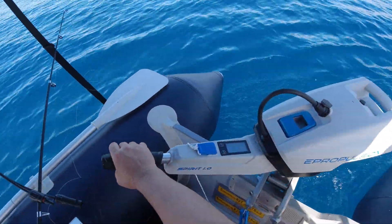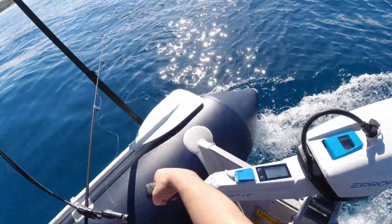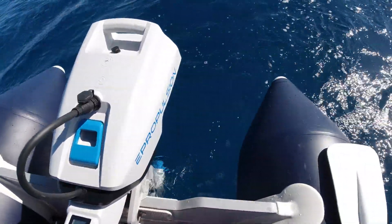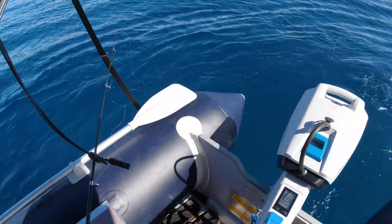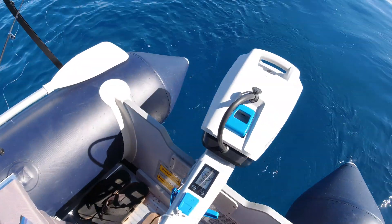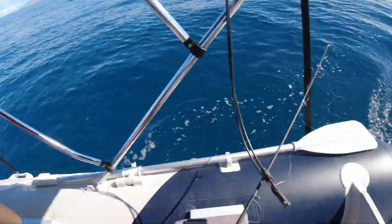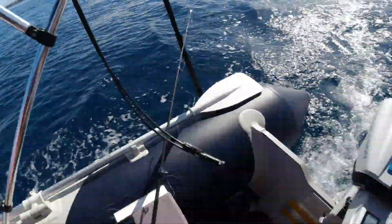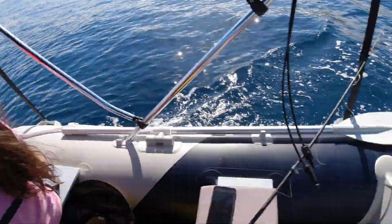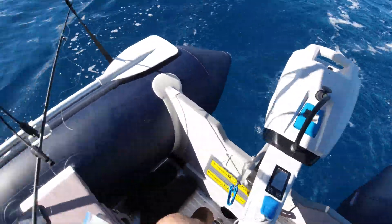Forward now — let's see what kind of tight turns we can do on a tiny little boat. Full throttle and turning. Pretty cool. You just want to match the shaft length to your boat. I'm hearing just a little bit of cavitation, but that's okay because I like the short draft of this motor for the reefs. That's about as loud as it gets. Full throttle again and turning — you can really just hear more of the water wash than the motor itself. Very, very silent.